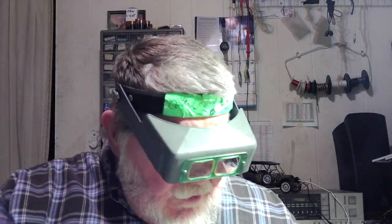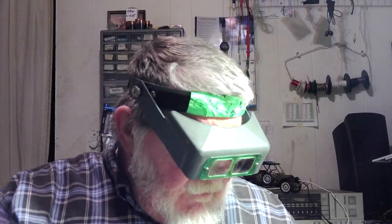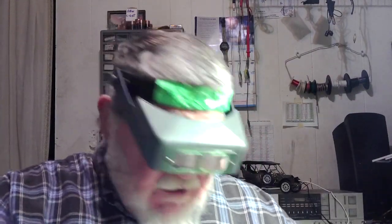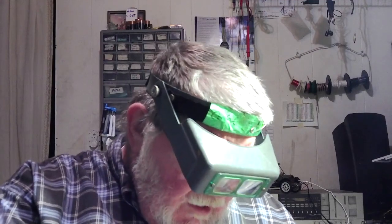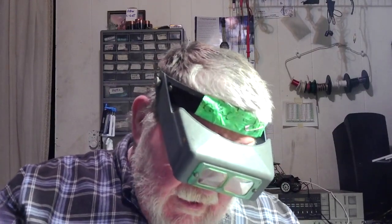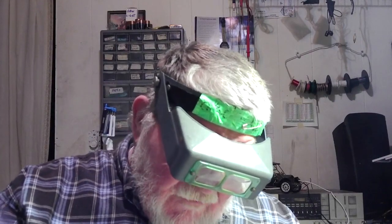So anyway, where we were just talking about the 6 or the 12BA6, we were going to look at some of the specs that they're talking about, and I'm reading out of the RCA manual. I didn't want to go into the maximum ratings, and a lot of these we can look at later on when we're actually in the radio, checking out voltages and all that. Right now we're just looking at the basic circuit, getting an understanding of how this radio works. Okay, so it says here plate supply voltage, and it's got 100 to 250 volts.